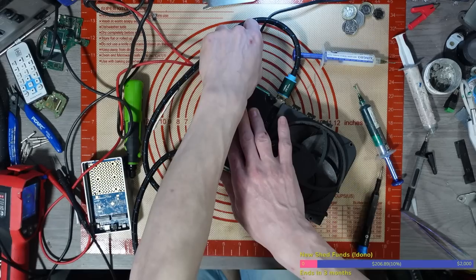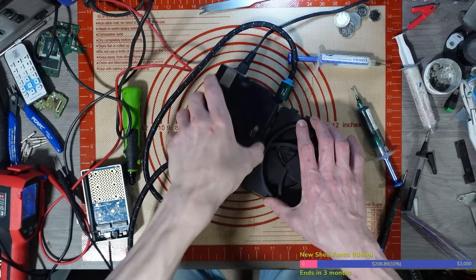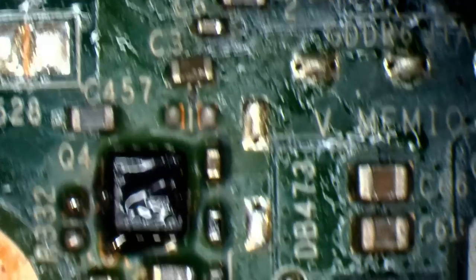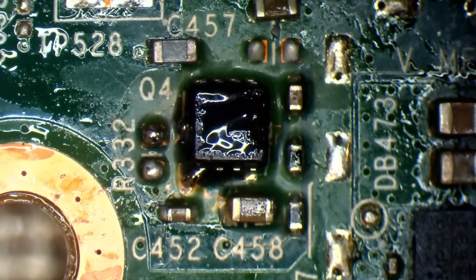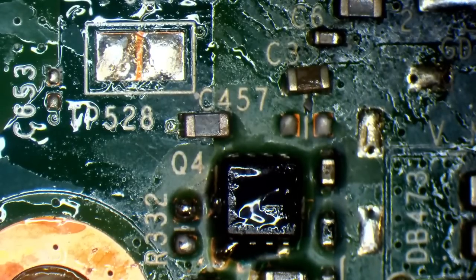We had a fan spin but it's not working. Unless we need all three of those pins connected — as far as I know they're all connected internally so I can't see that being it. Let me just check in diode mode on that MOSFET and see what readings we get.